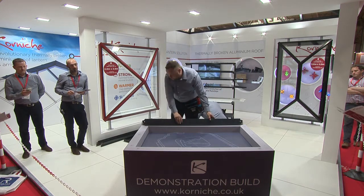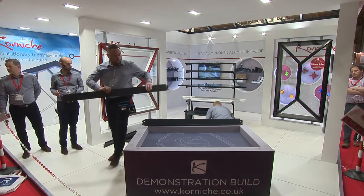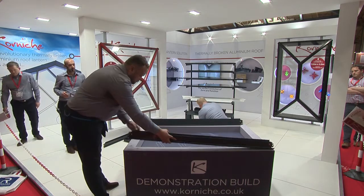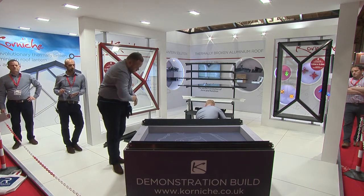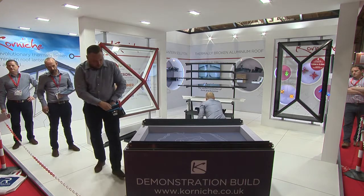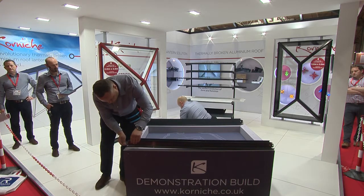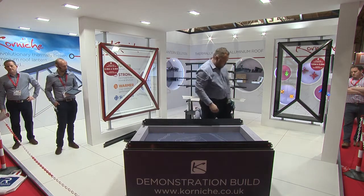Okay, so we're assuming that at this point the upstand's been checked, it's level and it's square, so Sam's going to get straight on with installing the eaves beams. The eaves beam comes in 4 sections, he's going to lay those out on top. There's some laser cut 90-degree brackets, a precision fit in each corner, which hold the eaves beam parts together and square while the rest of the roof is assembled around them. Meanwhile, Bradley's going to build the spider structure.